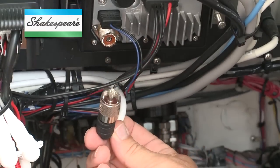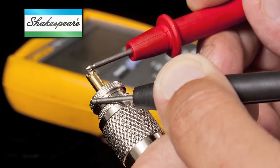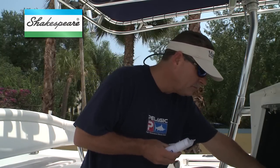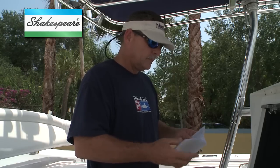If all that's okay, check your coaxial plug for corrosion or damage. A simple ohmmeter test may help determine if the PL259 connector installation is faulty, but first, be sure to read the specification sheet for your antenna to see if it should read as an open or a short circuit when functioning correctly.